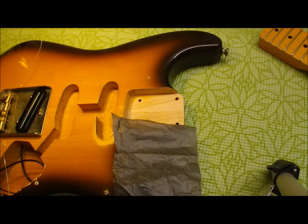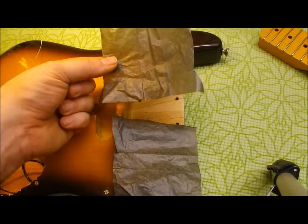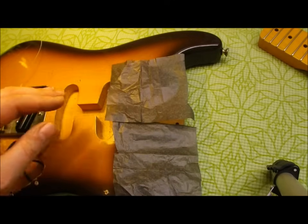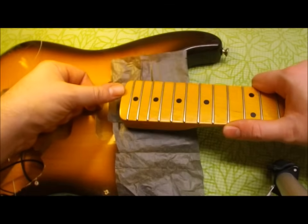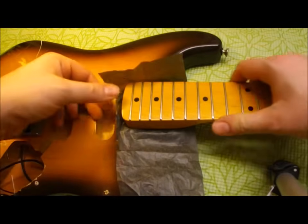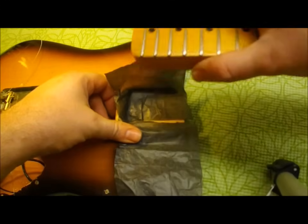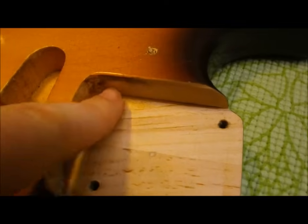Here's the trick I'll use for fitting this. For those of you who are too young to remember, this is carbon paper, which you can get at office supply stores. It was used in the time of typewriters to make duplicates — they'd type through two pages using this and it transfers a little bit of pencil lead to the opposite side. I'm going to surround the pocket. I want the neck to fit up really close to the front edge. So I get it where I want it, press down a little bit into the pocket — not too far — then when I pull it out, it leaves a little bit of black just on those areas that are too tight.